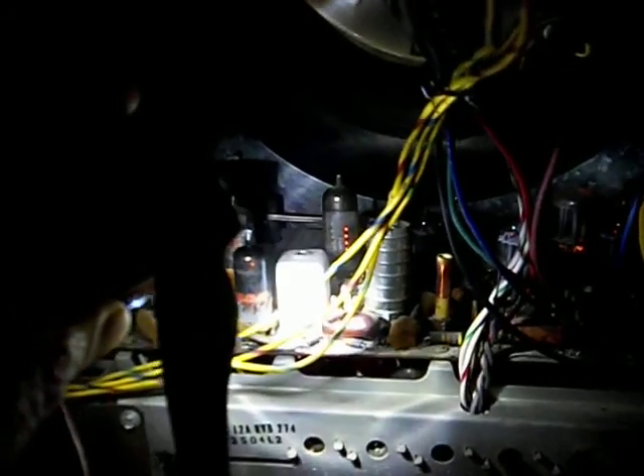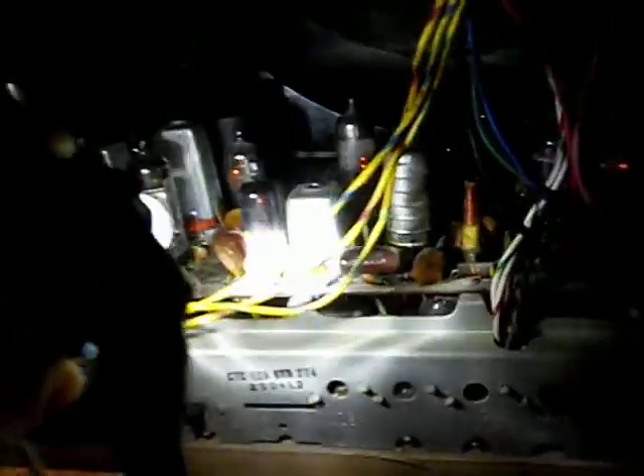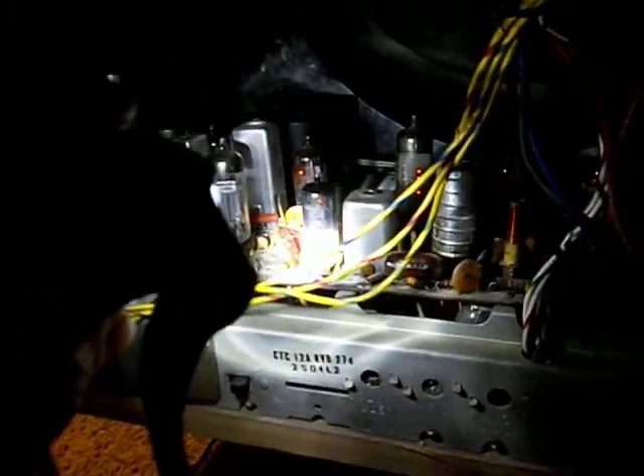I ended up figuring it had to have something to do with a reference oscillator. This is the 3.58 MHz oscillator inside that can — the burst phase detector transformer. That tube right here is the burst amp. I figured it had something to do with the burst, and sure enough I pulled that tube, subbed it, and the problem went away. The old tube had a shorted pin 1, which is a grid, and a more solid short on the cathode, which is pin 2.